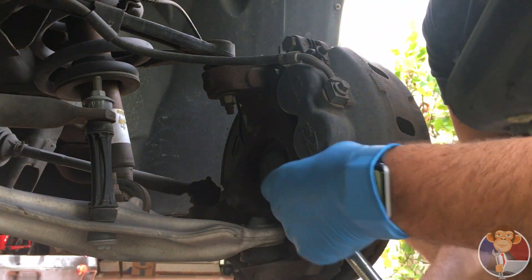I'm going to go ahead and change out all these things, put the rubber on. I put the new rubbers on — all I did was get a screwdriver in there and pry them out. Put the new hardware. Now the slides — I'm going to clean these with a rag, then I'm going to get the grease and apply a small bead, rub it in a little bit. Then I'm going to put the slide right in, spin it, and do that with each one. Make sure that they're nicely lubricated.